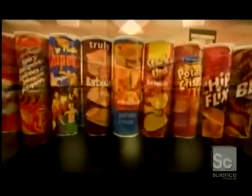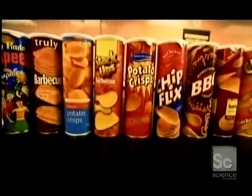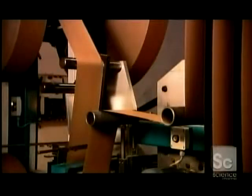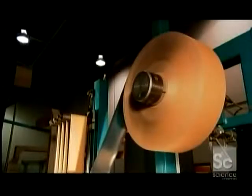The process for making these tubes starts with big rolls of plain brown paper and foil back paper that help keep the chips fresh. The streams of paper travel across rollers that apply a coat of glue. The paper layers then twist around the mandrel that's turned by a big belt, which also presses the glued layers together.